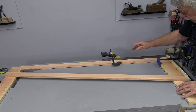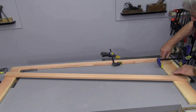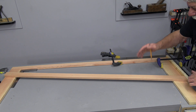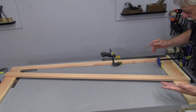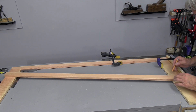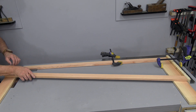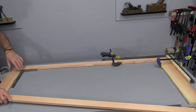Just so you can see the layout: I have my carpenter's square clamped to the wood at the back, and this wood is clamped to the square at the bottom. The square is actually lifted off the deck a little bit — I have a couple of thin pieces of plywood under it. I want to make these cross pieces, and rather than do all sorts of measuring and angles, I'm just going to lay it out the way it's going to sit. I'm just going to mark it like that, and I've got one at the other side. I can mark that one as well and then cut those inserts — I'll make two of them, one for each side.